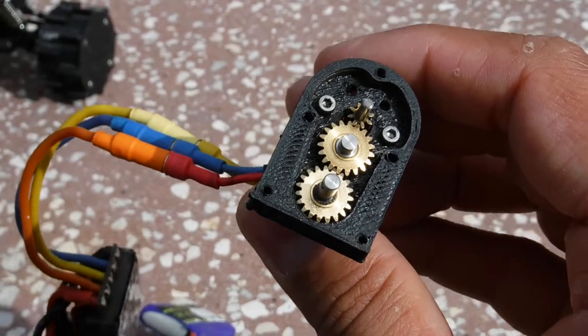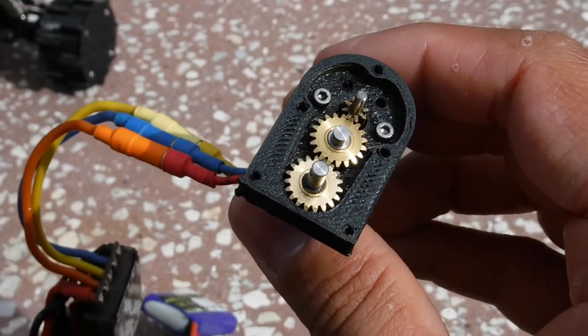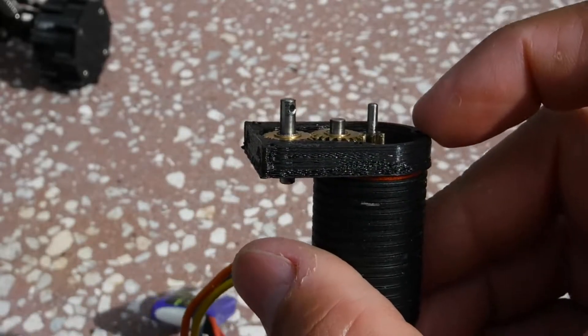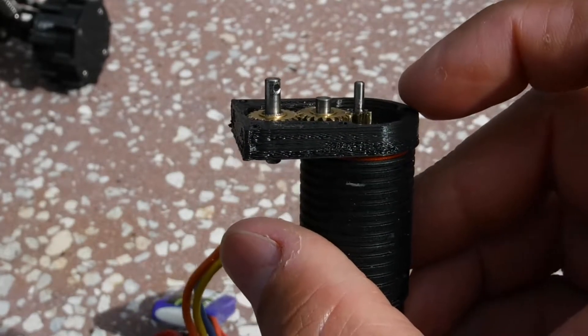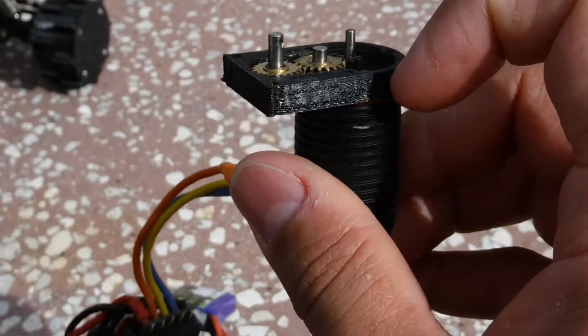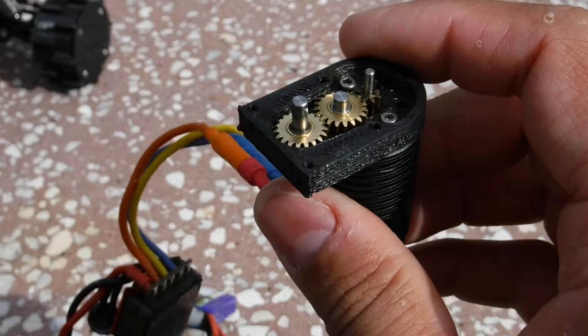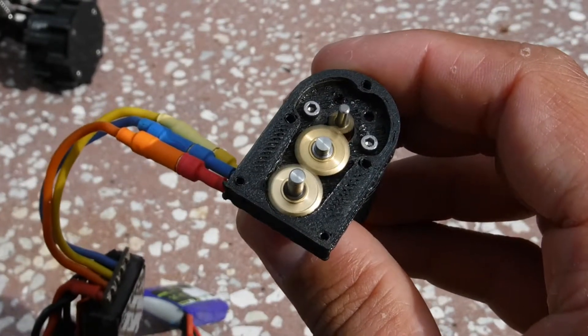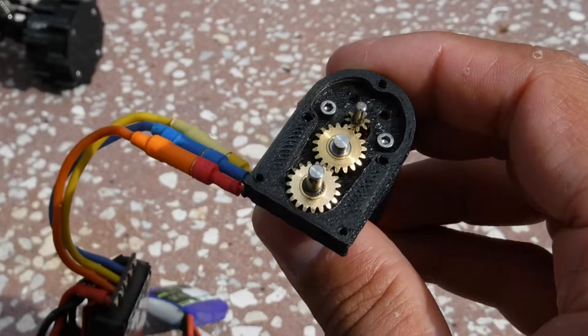You can see everything works fine. I put four mounting holes for the motor in this design because the more mounting holes, the less vibration and the more contact you're going to have to the plastic piece — since it's 3D printed, that'll give you less warping of the part under hard conditions.